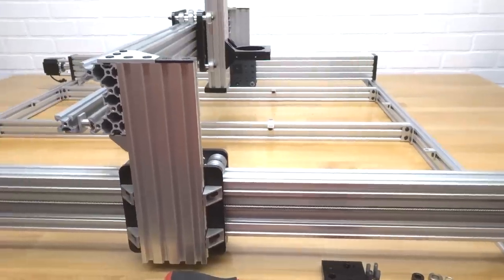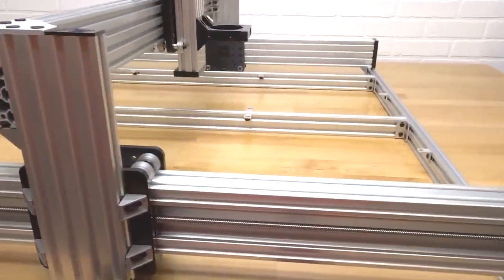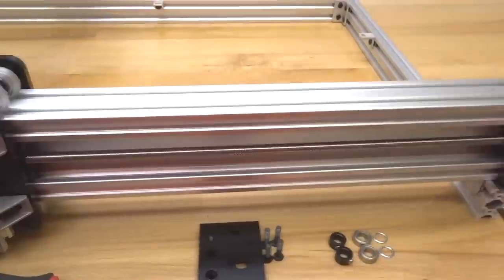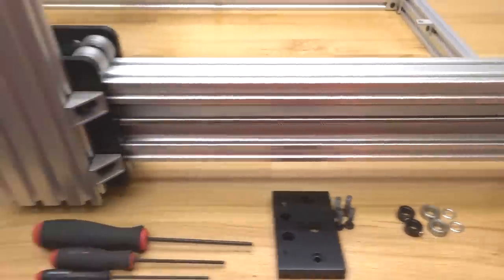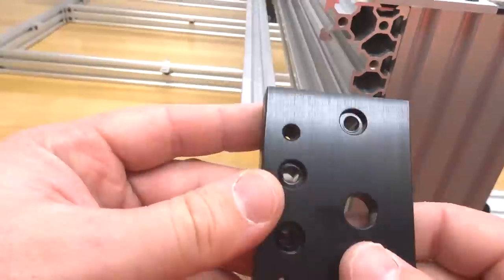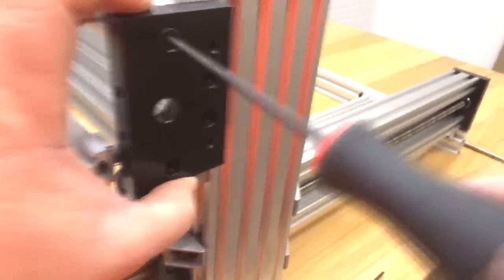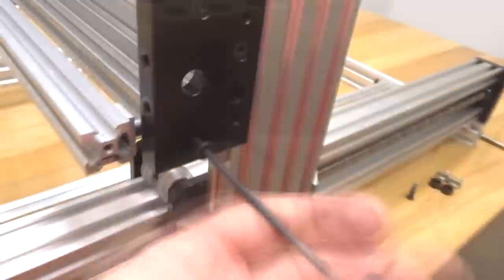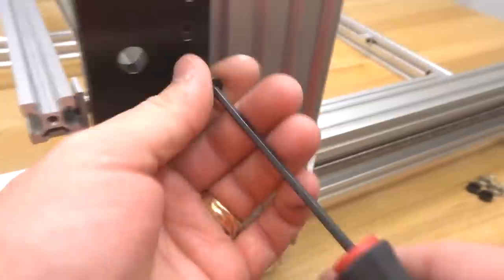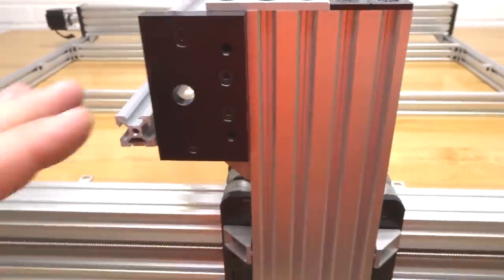All right, guys, so now that we have our machine rotated 180 degrees, we're gonna go ahead and finish up this process by mounting our C-beam first, and then we'll add our lead screw with our additional parts. So once again, making sure the recessed hole here is facing inward, we're gonna go ahead and mount this to our C-beam. Perfect. C-beam end mount is mounted.